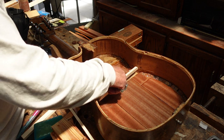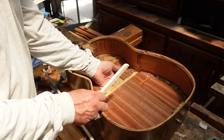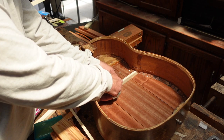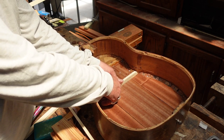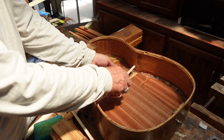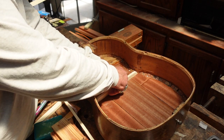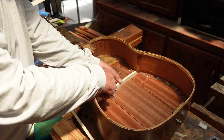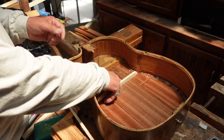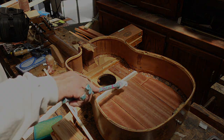There's a little bit more to do. We want to remember that this part was sunk in just a little bit, so when I clamp this down I'm going to put a piece of wood on top of the clamp in the middle so it pushes this up just a tad. That way the other two clamps will push down and suck up that low spot that's been a problem right here.